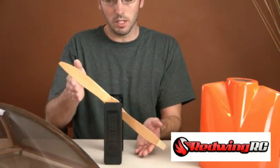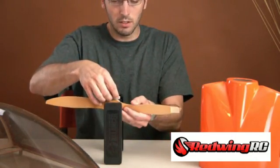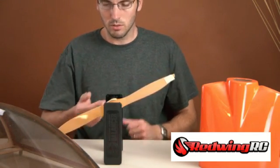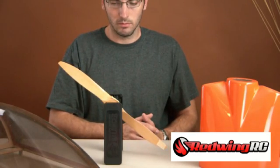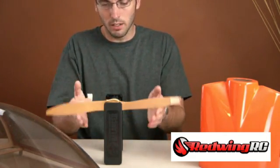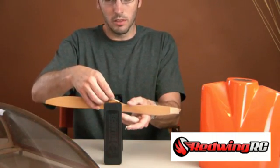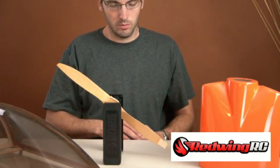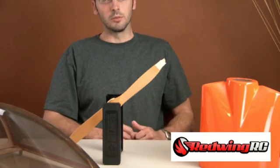It's falling a little more slowly on this side, and I bet this side will fall even more slowly — it's starting to round out. I'm going to add a little more just dead to the center since both of those seem to fall pretty evenly. Still falling a bit, but holding pretty steady. We're pretty centered on this side weight-wise. This one's still a little heavy, so we're going to put the weight on the opposite side that was heavy, but on the top side, of course. Holding still. Holding still. Mystery solved.